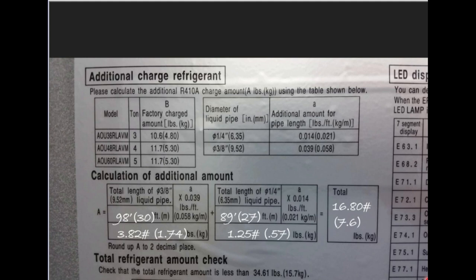In the event that there's a refrigerant leak, the refrigerant must be recovered, and then recharged into the system once the repair has been completed. You lost the charge, so you got to recover whatever is in there. You can't pump it down because there's moisture in the system because there was a leak. So you got to recover it and make sure.